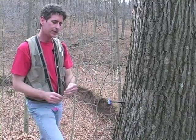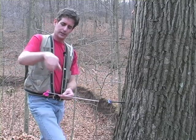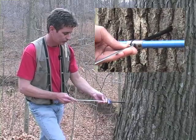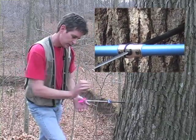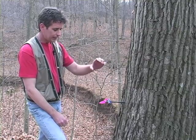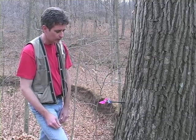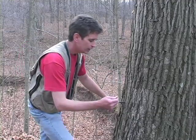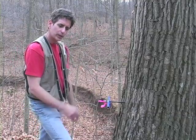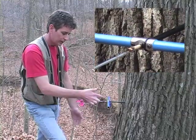Here's where the spoon comes in — it's curved. I'm going to take it so that the curved side is up and slip it in the top of the bore. Gently — it is relatively thin metal, so you don't want to force it and potentially break it. Slide it in and insert it all the way. It has teeth at one end that grab the end of the core. The core is still attached in there, so now I'm going to unscrew it a half turn — counterclockwise. That broke the core off, so now I can gently pull it out. And there comes the core.